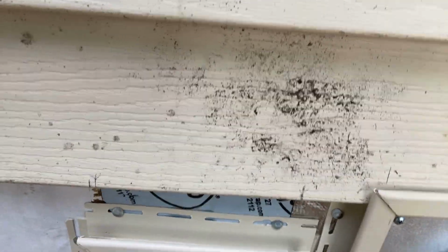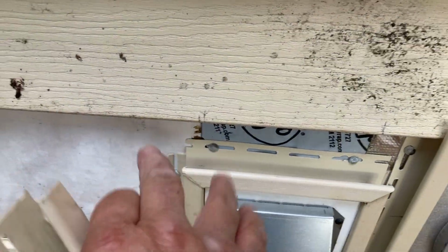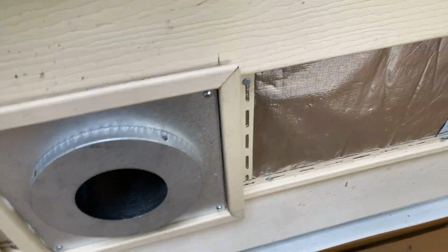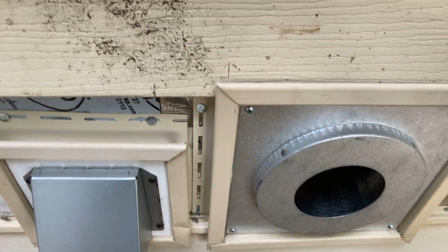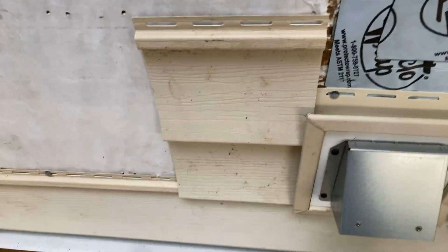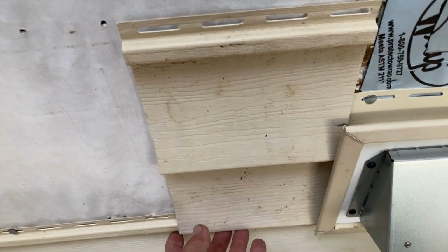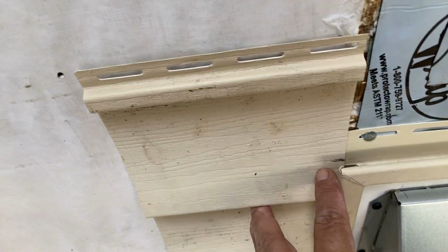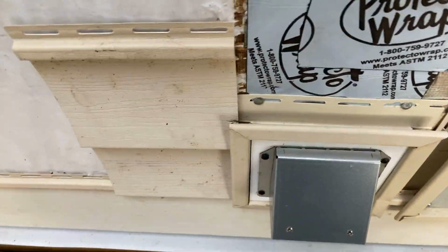And I do that on all the sides. And that gives me the position of where it's going to get cut to go around the unit, those squares. To do the sides, to get the depth, or how deep I have to cut it with a junk piece, I put it up against, put the straight edge across the top and mark that. And that's going to give me both sides, because this is level and square.